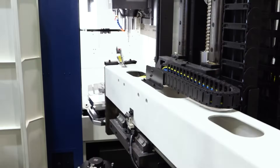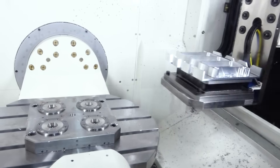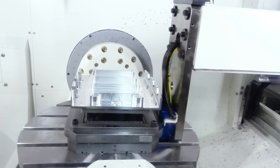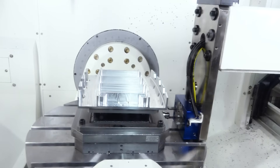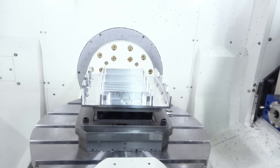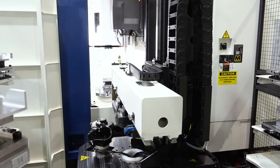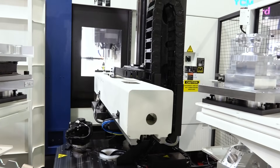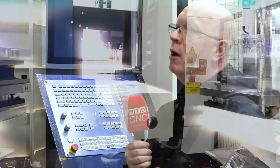Almost 99.9% of customers I talk to today say, if you had a guy that could set this machine up, I'd be happy to buy it, only because it can run by itself after that. And that's basically what this machine can do. If you've got two levels of seven and seven, you could put 14 different parts on it and let the machine run 14 different parts at a time. All you have to do is change out the pallet and put the next part that needs to be run. This machine allows you to do a truly done-in-one scenario.